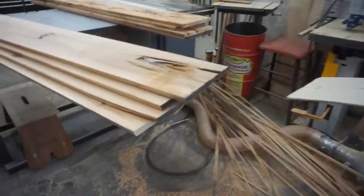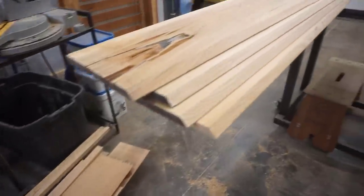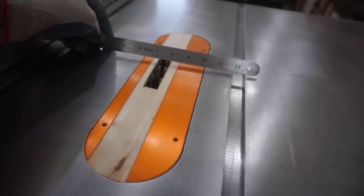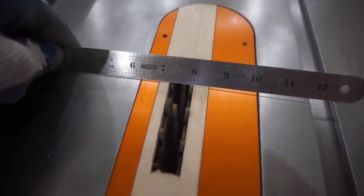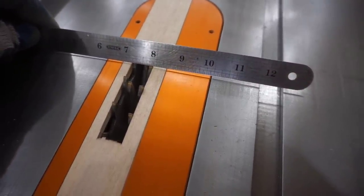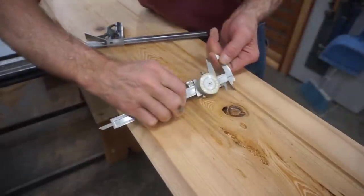Notice that I use my exclusive Grote tangent ramp roller stands to rip long wide boards like these by myself with ease. After ripping those bevels, I oriented and stacked the beam face boards to stage them for plowing dados next. Using a Forest Dado King blade set to exactly 3/4 inch wide and 3/16 inch deep, I adjust the rip fence so the top of the dado is 7 7/8 inches from the miter's long point on the bottom of the beam.